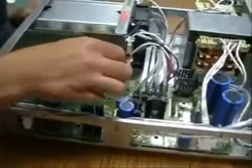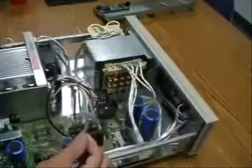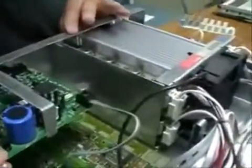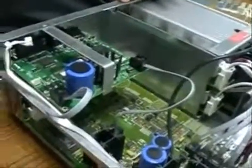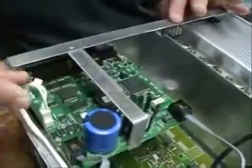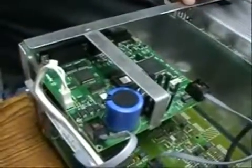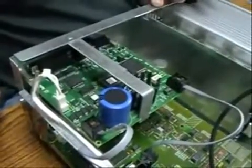The connector that gives stability to the GPIB board has been installed. The next step is to connect the cables. One serial cable gets connected from the control board to J107 of the GPIB board. The other serial cable from the front panel gets connected to J108 of the GPIB board, and the cable gets connected to P101 of the GPIB board.